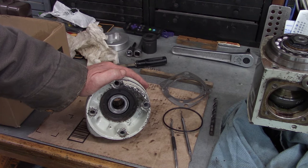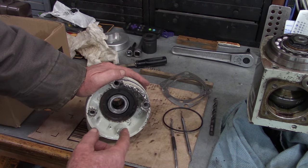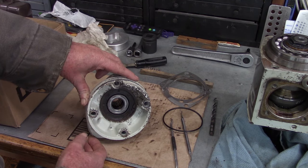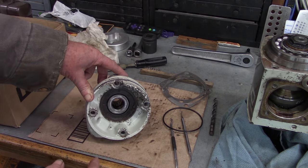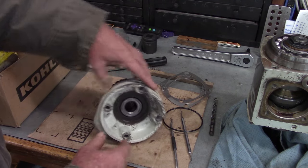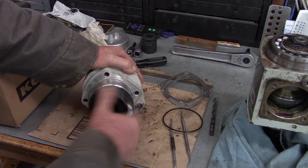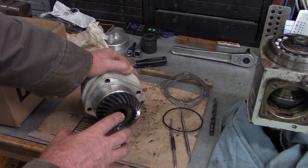This seal is not easy to change. This one isn't leaking — there's no evidence of oil coming out or water going in — so you might be better off just leaving the seal as is. I'm going to change this one because I have everything to do it. I'll try doing it with the shaft in place and we'll see how successful we are. I've been very careful not to get any dirt in the bearings and they still feel silky smooth — no roughness, no crunch. If that happens, you're pretty much committed to tear it all the way down.